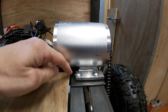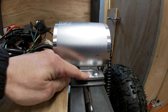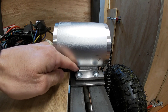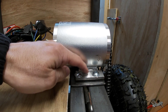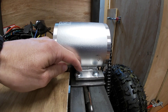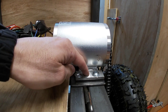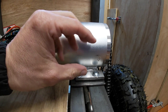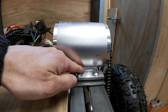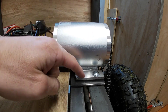Here's the solution: I've bent the foot back as straight as I can. I've got a thick piece of reasonably high-grade steel with a couple of holes drilled in line with the foot, and I've covered as much of each half of the foot as possible with this steel plate - there's one on each side. The idea is like a giant washer: by sandwiching the foot between the plate it sits on and this plate above it, hopefully the steel is too strong to bend and it'll stop the foot deforming again. Then just reconnect the electrics and try again.